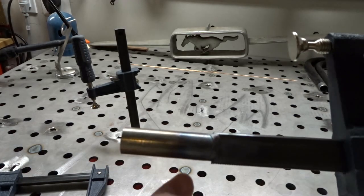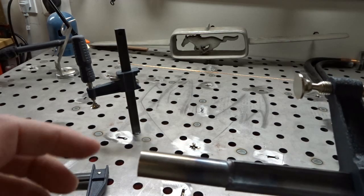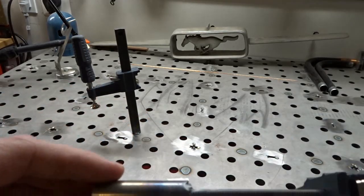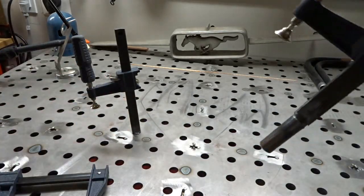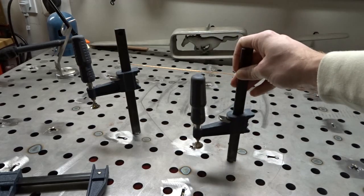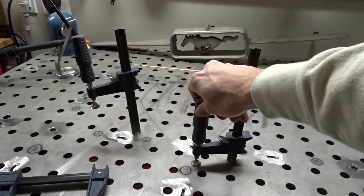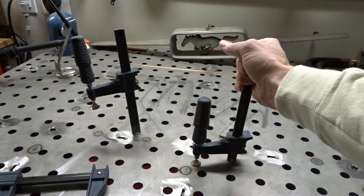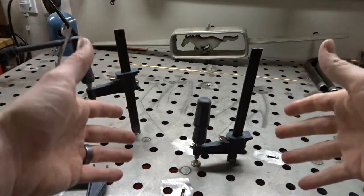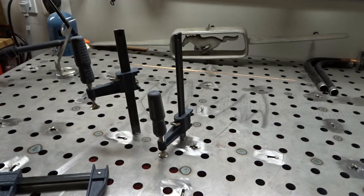Once that's done, we're going to cut the 5/8 inch round bar, prep it for welding — it's two inches long — and then weld it on the tip, right in the center, all the way around. What it's used for is you drop it in these holes in the table, bring it down to whatever you're working on, twist it, and as you twist it, it rocks back and locks. It's tight — you can't pull it out — and it holds your material down to the table.